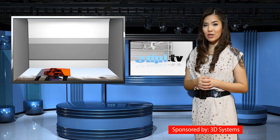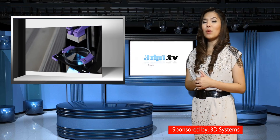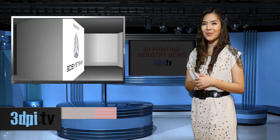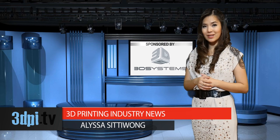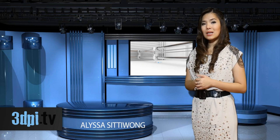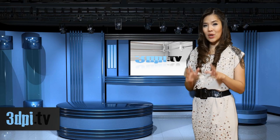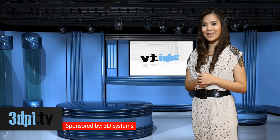If you want your own DLP 3D printer but lack the technical skill or free time to build your own, Hill will also be offering the printer at $1000 in preassembled form. Hill's DLP machine is quite little, with a build volume of 60x40x100mm. According to the project site, it takes about 2 minutes to print 1mm with a layer height of 0.05mm, so a 40mm tall object would take approximately 80 minutes to complete.